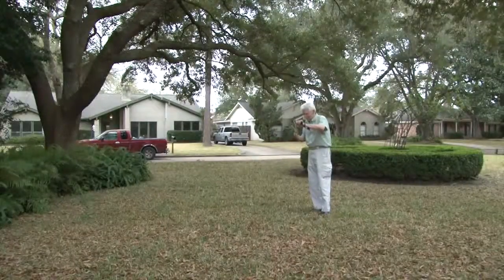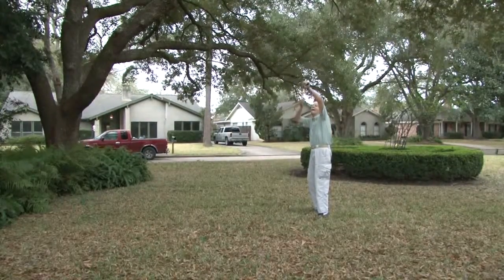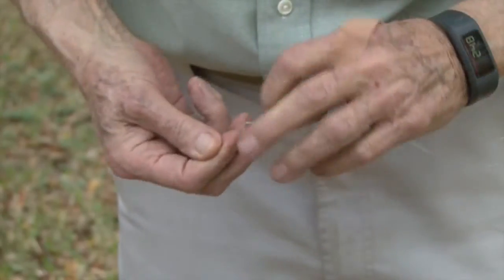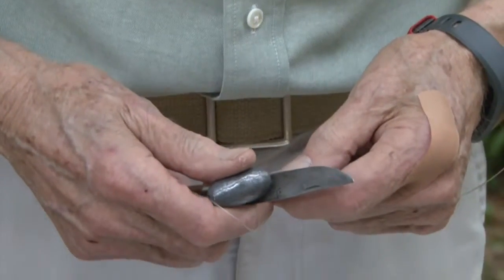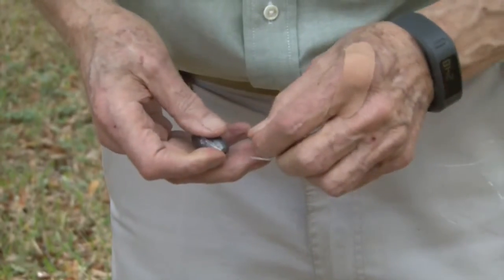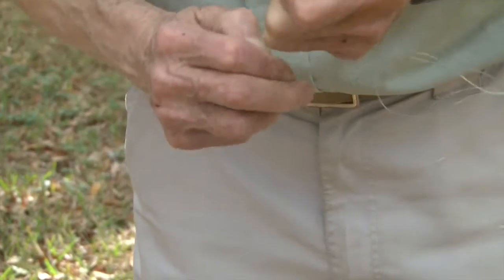The easiest way to gain elevation for your field antenna is with a slingshot, fishing weight, and monofilament line. About 6 ounces of weight has been added to the spool to hold it on the ground when the shot is made. The 2 ounce weights work best and will give you the best height, and the 4 ounce weights are necessary for trees with dense foliage. It is a good idea to have extra weights and a pocket knife since not all attempts are successful. If your first attempt doesn't put the line where you want, just cut off the weight, wind the line back on the spool, and start over. If you are just pulling up the end of a wire, you can use the fishing line; however, if you're hauling up the LDG tuner, pull the light rope up first.